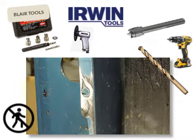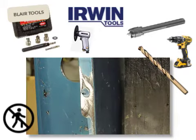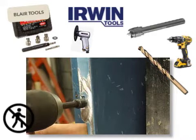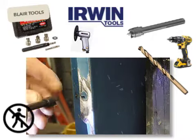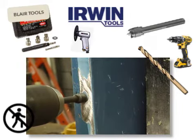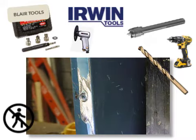Let's change angles to get a better look. Now the Blair tool is spring loaded, so technically you could use a punch to get things started. However, if you do that, it is more likely that the cutter will walk on you, resulting in broken teeth. Just drill a pilot hole, then use the Blair cutter, and you're done. Let's take a look at another one. The next weld up is the same procedure. Grind it flat. This removes any imperfections in the weld.